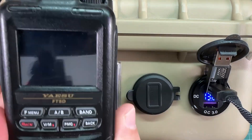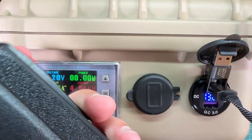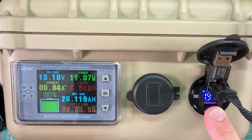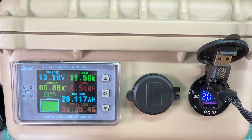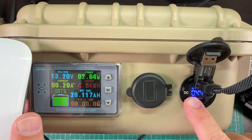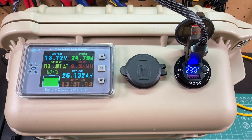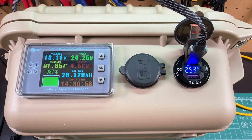Going 5 watts out — life is good. Here's my Yaesu FT5D with the battery pack that Kevin W0AEZ makes. Go ahead and plug this in. You can see 5 volts — as soon as it starts charging, 1.78 amps, almost 2 amps going into that. So that's great — 9 watts going in. Here's my Apple Magic Mouse that I take with me portable. You can see we're charging there — 5 volts, 0.44 amps. This will also charge my iPhone very fast. You'll see this goes to 9 volts when charging my iPhone and putting quite a bit of power in.